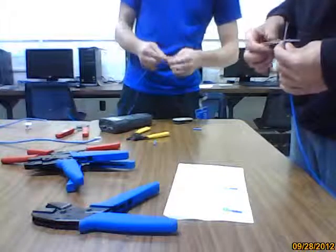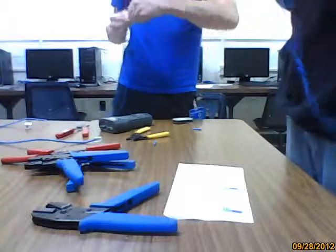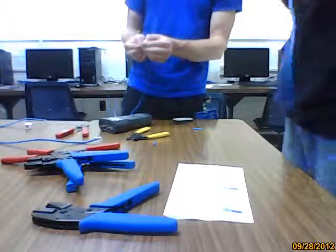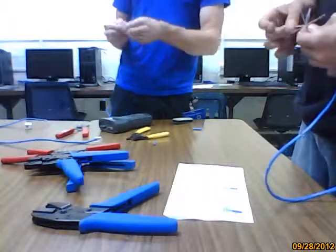And then brown, white, brown is your last set. So when you do get all your wires arranged, what you want is orange, white, orange, green, white, blue, blue, white, green, brown, white, brown.